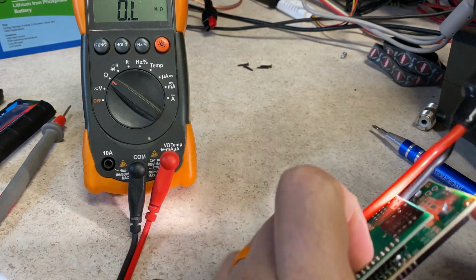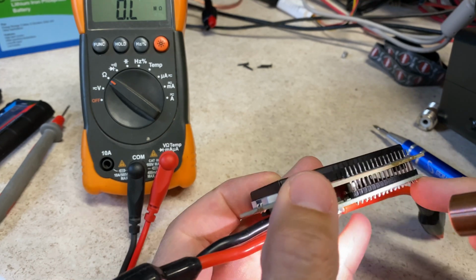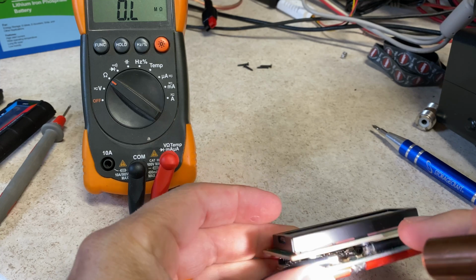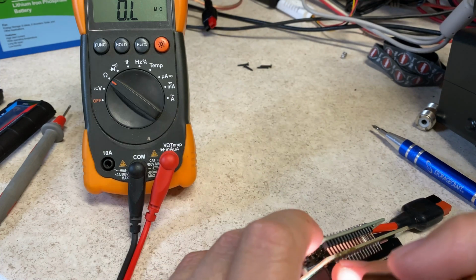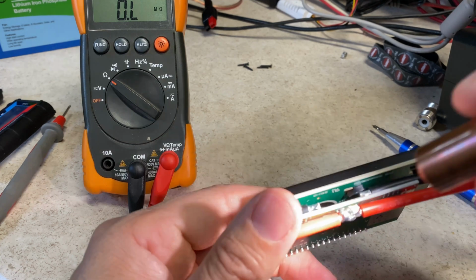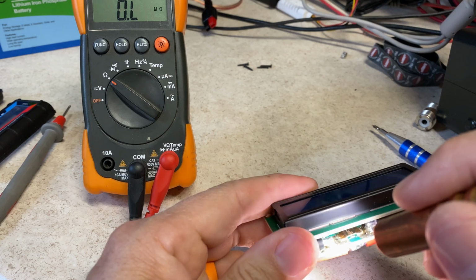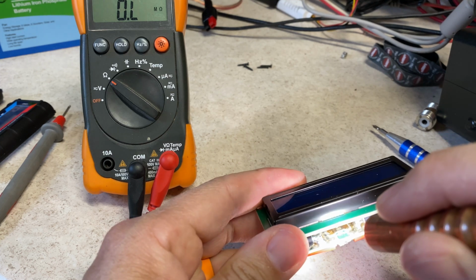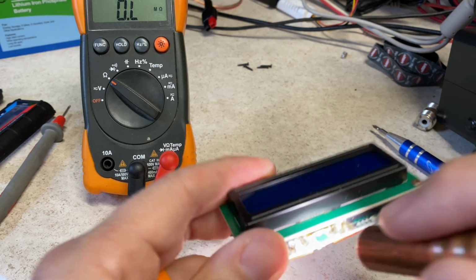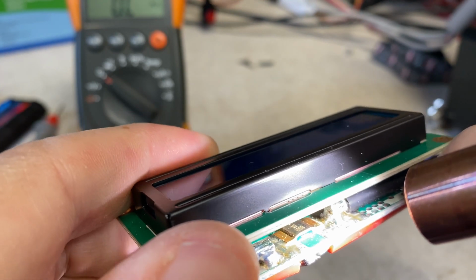None of the components on this board, the bottom board, which appears to be the little board if you will, appear to be the ones that do all of the electrical carrying. It looks like this is just sending sensed information up here for it to get displayed. The only component here big enough to carry even remotely 50 amps or larger of current is that big resistor that you have there. And you can barely read it. It says R001 5%.